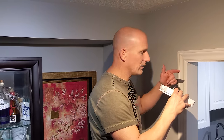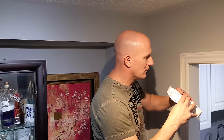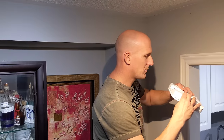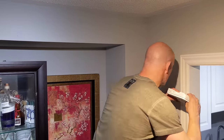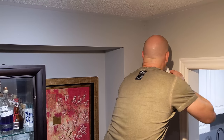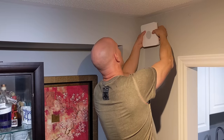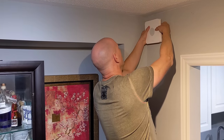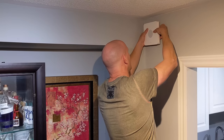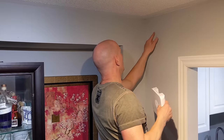Some kits will have an installation paper template, but this one doesn't, so you'll have to do it this way. I'm just going to center the screws — it doesn't have to be 100% perfect, just roughly where it's going to go. I'm going to press up against the wall, leaving a little bit of room since we're putting it in the corner, and press firmly to make a mark. I can see two dots and that's where I'm going to install this.